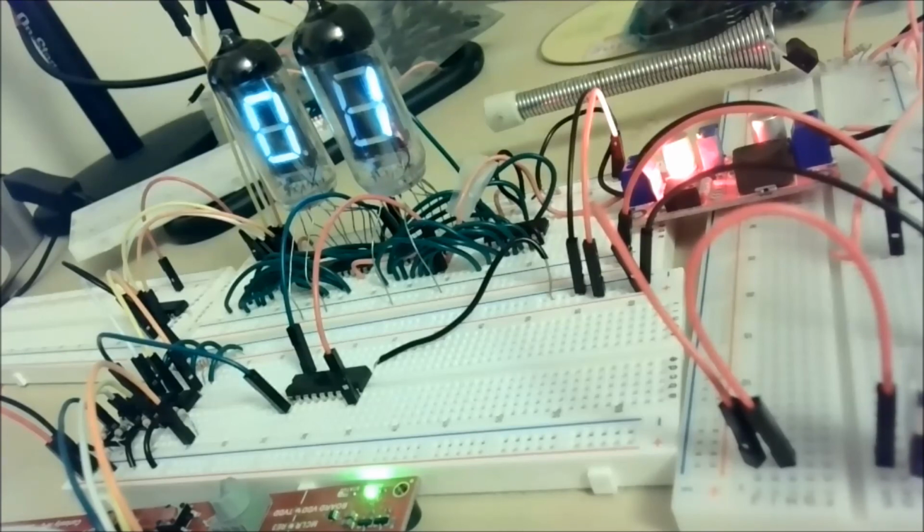And so these regulators are a similar type of thing. You can take a voltage supply, whatever it is, 20 volts, and you just change the duty cycle. If you want 10 volts out, okay, 50% duty cycle, smooth it with a capacitor, boom, you're good. That's the idea behind it. And then the other way you would do it for switching it up, I think you just switch the direction of it. So if you want to go from 10 volts to 20 volts, you apply 10 volts to your capacitor, then you apply 10 volts in the reverse direction, and you're able to charge it up to a higher voltage, something like that.